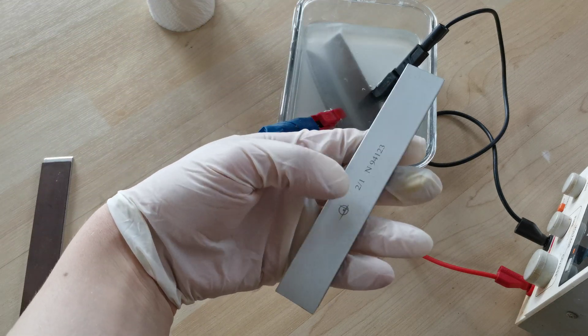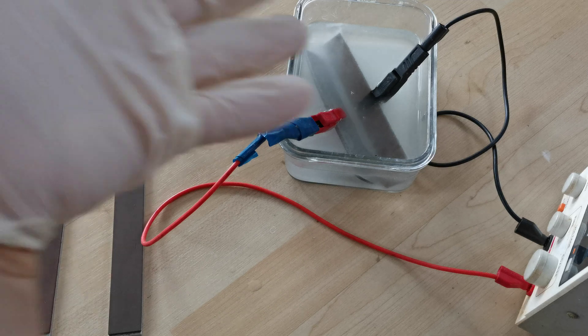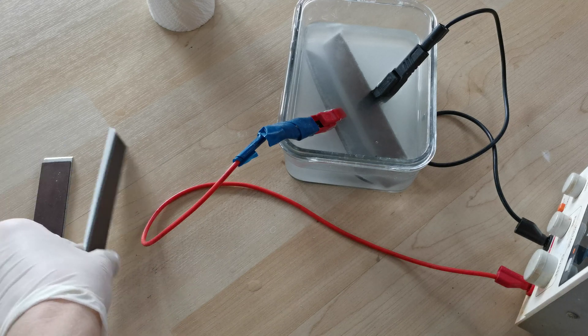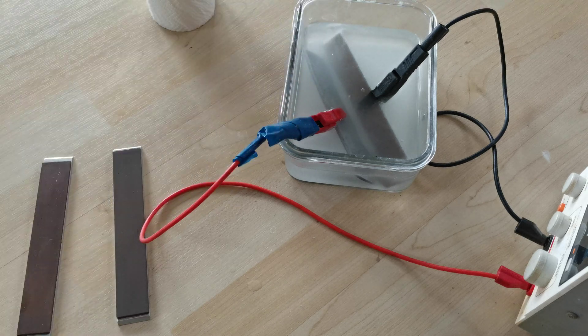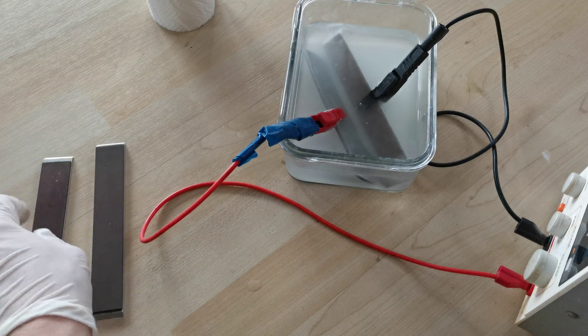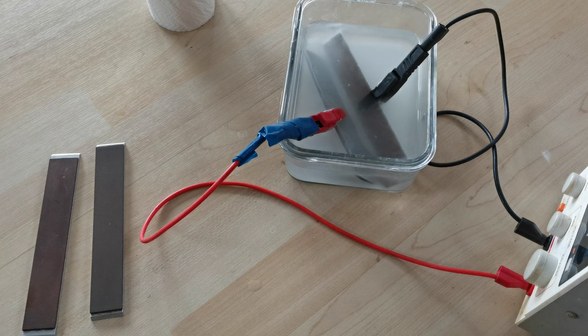It really depends on how much your stones are clogged and how fine they are — the finer, the longer it takes. I think this 2-1 micron one will take maybe even 20 minutes. But again these are just my experiences, and if anybody has experience with this process to dress and clean stones, I'd be very interested to hear your opinions. I mentioned in the beginning that you can use acid for cleaning these, and you could in theory also use acid as a replacement for baking soda. Anodization works actually even better in concentrated sulfuric acid, which I have tried. But concentrated and even diluted sulfuric acid is really dangerous, and it also involves having to take off the metal plates from your stones, so I don't really recommend it.